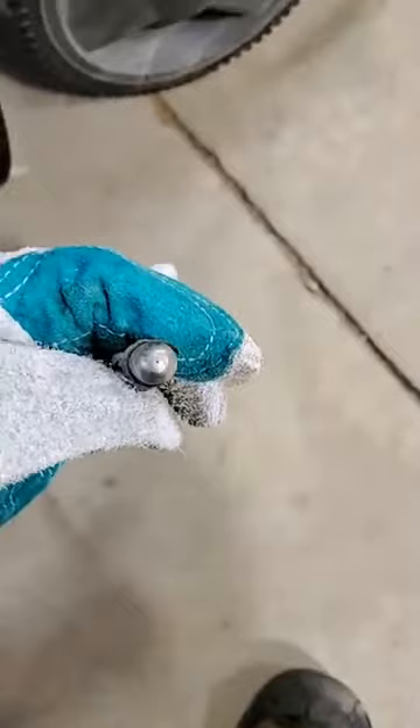The last option — and a very effective one — is the jetter. It's not just a power washer; we use it as our jetter. Let me grab my glove — I don't want to touch it without gloves. This head looks like this: you have one hole in the center on the front, and then several that shoot backwards. That's what gives it the ability to clean it out. This works for ice, this works for grease, this works for roots. Some bigger jet cables have chains that spin and can knock roots off the pipe.